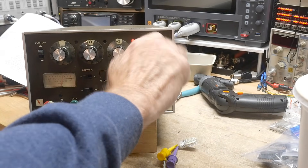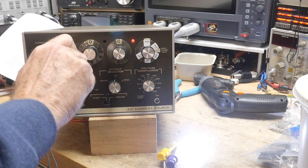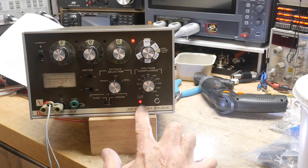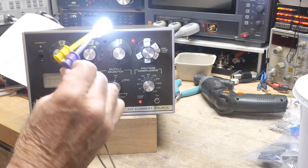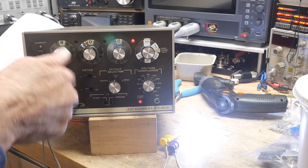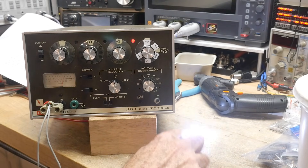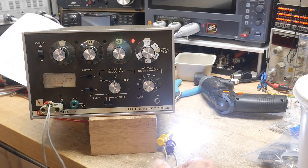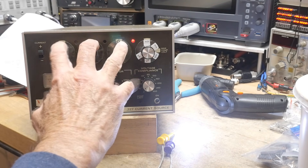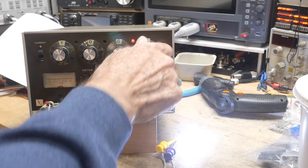One thing I've noticed — let's go back up to the 100 milliamp range. I'm going to go to 200 milliamps and this light came on, which means we're under voltage compliance. I had set this voltage compliance to 12 volts because that's what this light bulb is, and now we're in compliance at 12 volts — it's not going to give us anything more; it's going to clip at the 12 volt level until we go down below it. This thing runs at about 120 milliamps or so, but at 100 milliamps we are in constant current mode and the compliance limit is off. All seems to be good. I like the new knob.